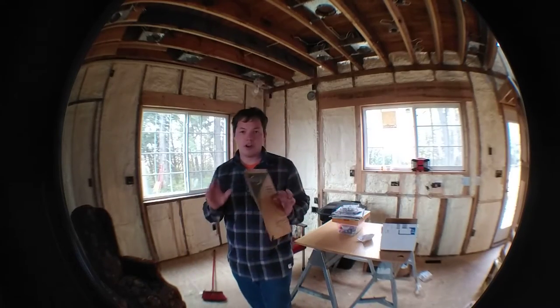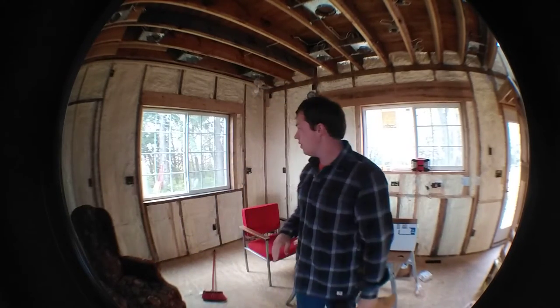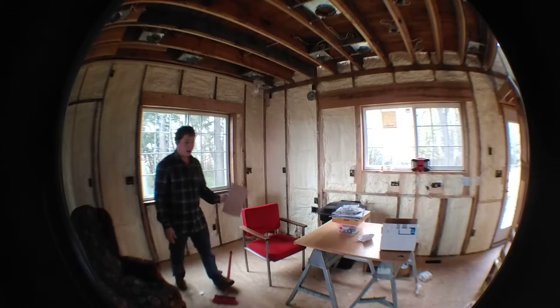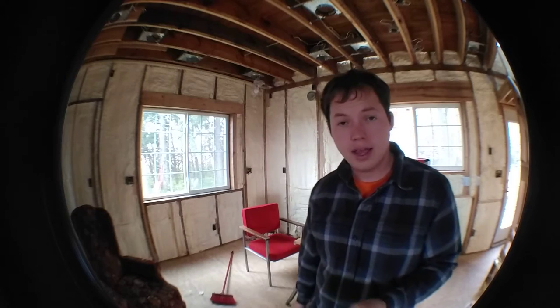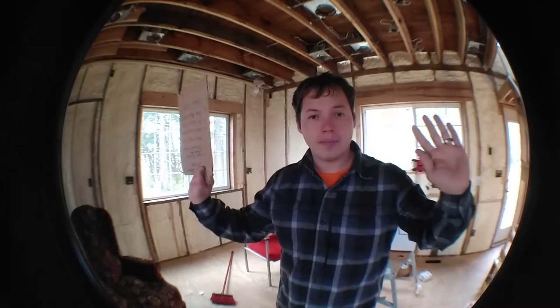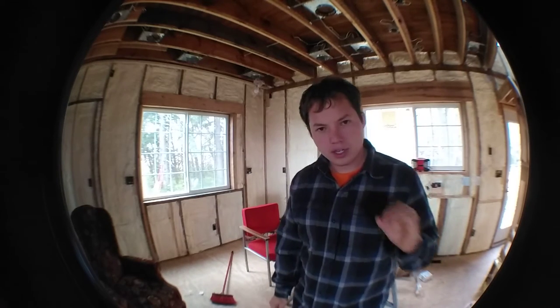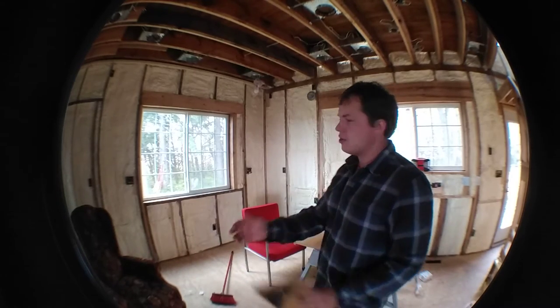Next up, and probably a very crucial item for the homeowner, is to document everything. Everything that is in these walls that has been spray foamed is completely obscured from view and locked in place. So what I did is I went from room to room in the entire house starting at the very top. First, I took pictures of every wall and all the way around the ceiling — any spot where there's going to be spray foam. Take pictures top to bottom, and if you want the photos to be even more useful, you can stretch a tape measure across the wall before you take the picture, which gives you a sense of scale.